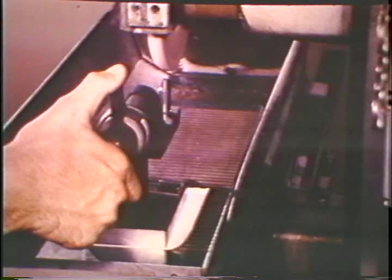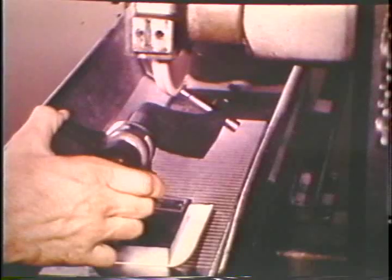Raise the grinding wheel and pivot the diamond back to the vertical position. Lower the wheel 2 to 3 thousandths and swing the swivel arm from pivot stop to pivot stop. Continue until the desired radius is reached. Remove the dresser and clean up the magnetic chuck.